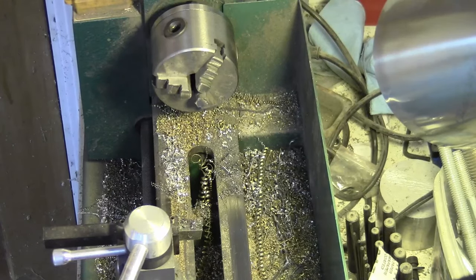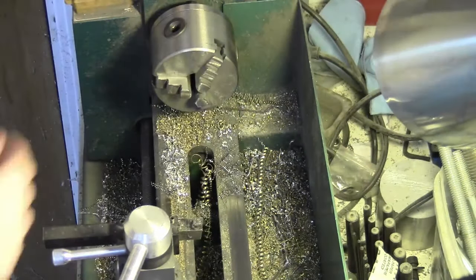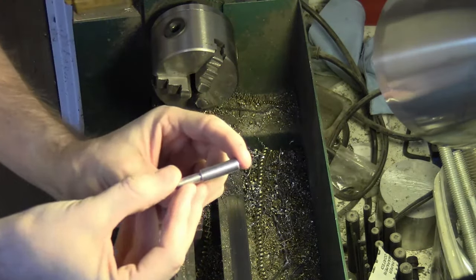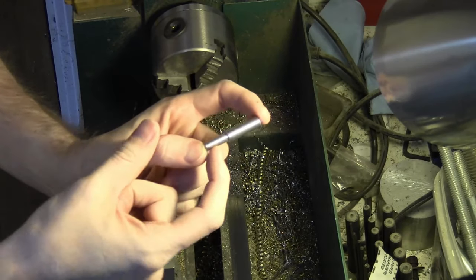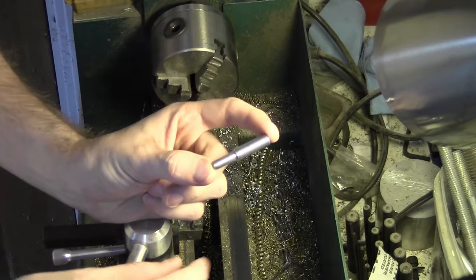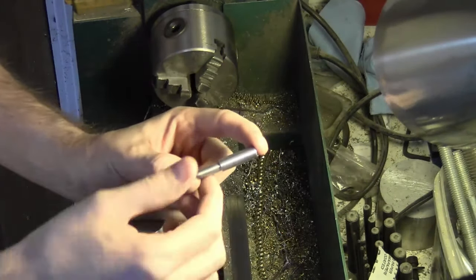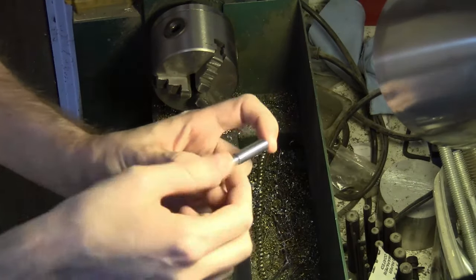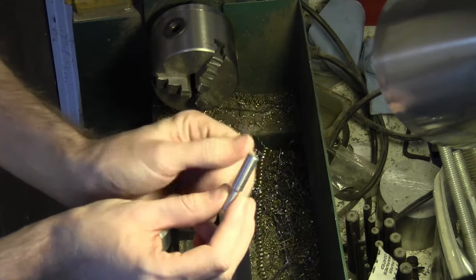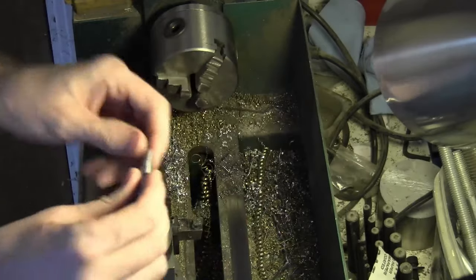Good morning, welcome back to the shop. We are making pegs for the spring-head loaded calls. I made one yesterday - this is what we're aiming for: quarter inch here, about three-quarters of an inch, a little less than about 700 thou of depth, and then a piece that's roughly 300 thou. It's thicker than this so it stops, and then we'll cross-drill this for the spring. This one's done - it's now our model or prototype for the other three that we need to do.